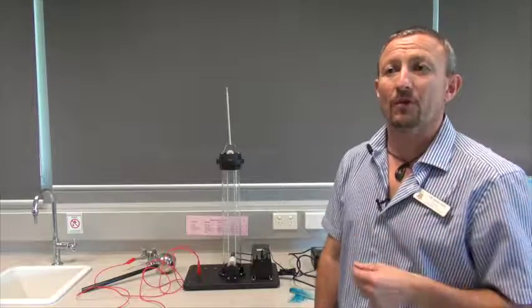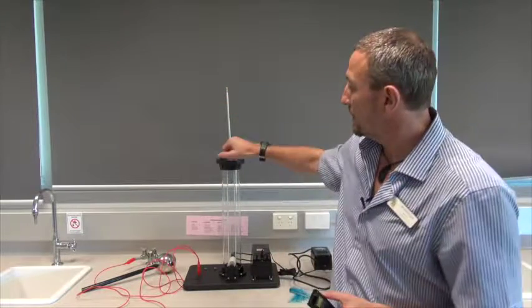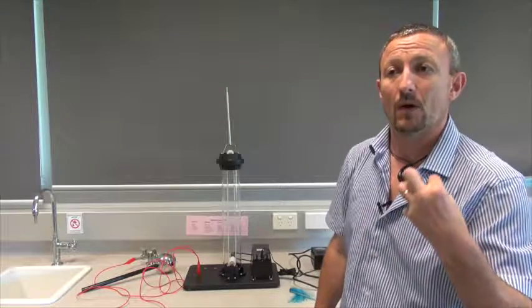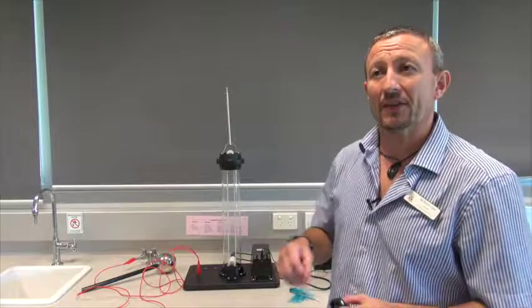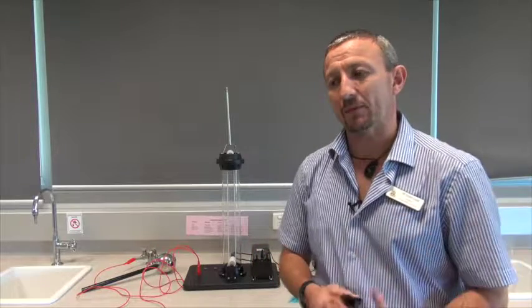So, at these points, the field becomes high enough to ionize the air particles, air molecules, which are inside here. The electrons that are attracted to the outside of the belt will then go onto the ions, forming positive ions on this electrode. At the comb, the ions are neutralized with the electrons, thus leaving the comb and the outer shell with fewer electrons, and the result is they become positively charged. As a result, electrostatic induction has been produced.